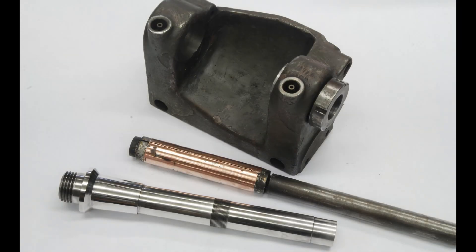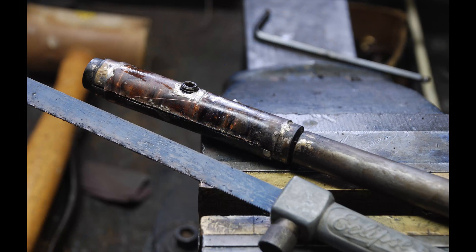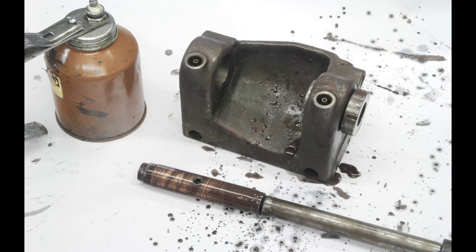My plan was, by being very careful with how much I ground off the spindle shaft, to have enough adjustment left on this bearing that I'd be able to lap it and then have it still close in and form a proper fit on the spindle shaft. To lap the bearing I was going to hold it in the headstock and do a little bit of engineering to determine the thickness of the shim on the bearing, close in given the new diameter of the spindle shaft, such that if I clamped the bearing tightly and then lapped it I'd end up with the right ID. I was able to reuse the lap that I made for the tailstock; however, I replaced the copper on it and also added a universal joint so I could use it with a drill. The white sheet is just a drawing spread out on the bench to try to contain the mess, and things worked quite well although it was messy.